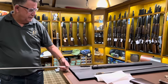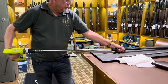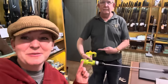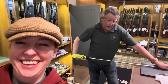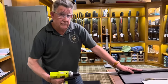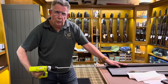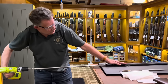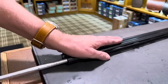So now what we do is give it a good old rodding with the drill. Pay attention to just past the chambers, past the forcing cone, this first three or four inches — that's where all the detritus happens: the burnt powder, the scorch marks from the plastic or fibre wads. That's the marking you'll see. Do it this way and polish it out. When you get to the end and the brush is nearly there, stop and pull it out.